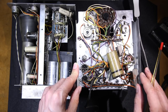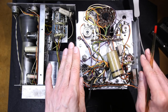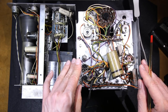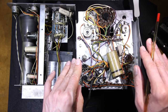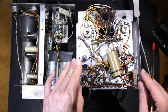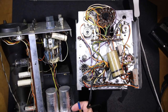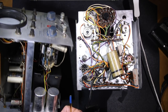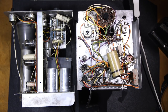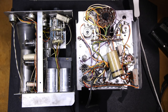So there'll be the power supply circuit board there, and the main curve tracer circuit board will be there as well. This one here will also be fitted with an adapter so that it will have a digital readout. That's already part of the curve tracer project. So because you can use an external digital readout with this oscilloscope, you don't need that little green filter with a graticule on it. So you don't need that at all. Just a gray screen like what you would see on this here is all you would need. You don't need that green filter, which makes things very nice. It also cleans it up. And of course the CRT looks a little bit brighter. It's not really, brightness isn't taken down by that green filter.